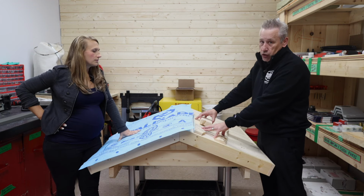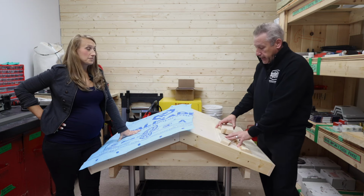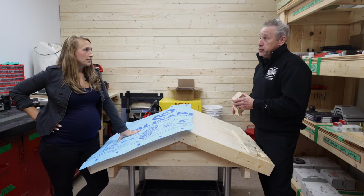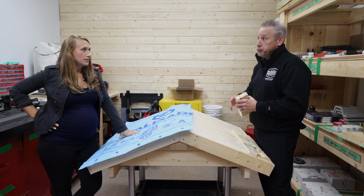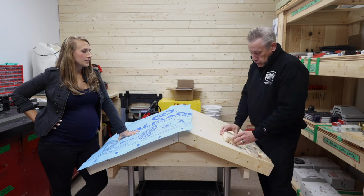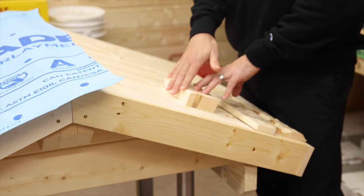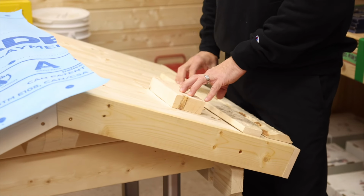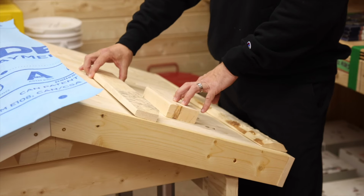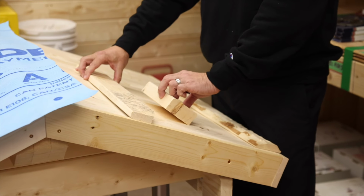One thing I'll also say is that people ask about 2x4 all the time. And you absolutely can use it. In fact, in a lot of the models you have, that's a 9/12 pitch, which is super steep. So by using a 2x4, you're giving yourself a lot more of a foothold when trying to walk up and down the roof. Whereas the 1x4 will work as well, but it won't be as nice on a big 9/12 pitch.